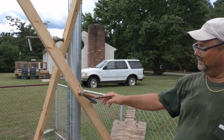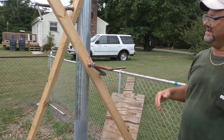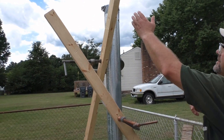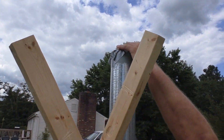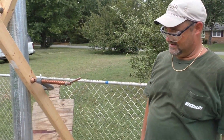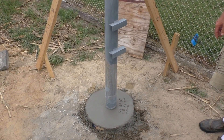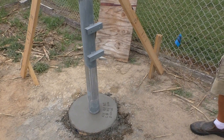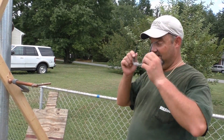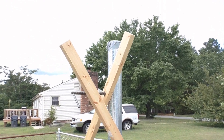We've got our braces up in here to keep it level — north and south and east and west. We need to put some duct tape up top. I've got some tropical storms out there in the Gulf right now not far from us, so we're not taking any chances. The weep hole kind of got sealed, but that's all right — we'll just drill another one and repaint. Now we gotta wait about seven days for the concrete to cure, then we put the pole up.